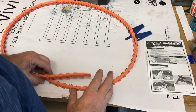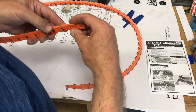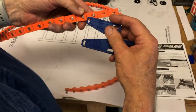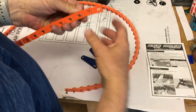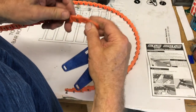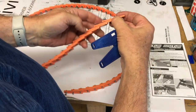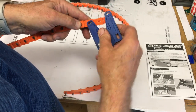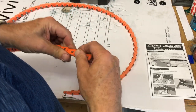I have to follow these instructions about how to just wrap this around the pulleys, check what length we need, take out any surplus links, and then rejoin it. These links are connected together with pins that are removable — you use a tool to grab hold of the little T, turn it around 90 degrees, and then a link can be taken out. You can see that that rivet-like thing goes through three layers each time, which gives it its strength. It should just pop out — easier said than done.